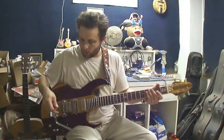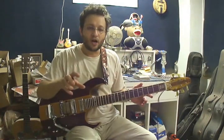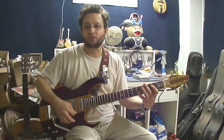It swells very nicely. I mean, the sweep is fantastic. So what's great is because it's got that 50s wiring where the input side of the volume pot is actually the output, and the output, the center, is actually where the pickup wires are wired to. If that makes any sense. The taper is much smoother. You don't lose any of the highs as you're going off. Think of it like a treble bleed circuit built in.